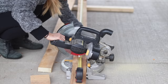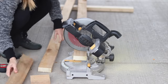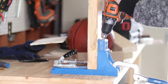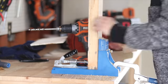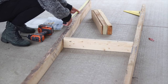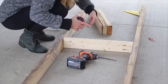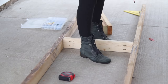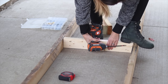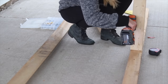This built-in closet is not going to cost me all that much because I'm using a lot of leftover materials. You can see these two-by-fours for my framing are kind of warped a little bit, but they're still going to work. I'm going to be drilling some Kreg jig holes in this framing for the center supports, and then I'm going to connect them all together, forcing them down against my cement driveway so that everything lines up even though they're slightly warped.